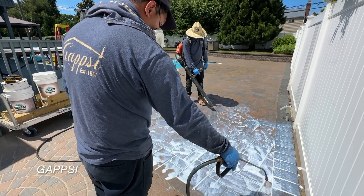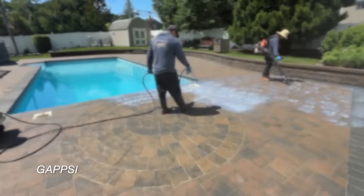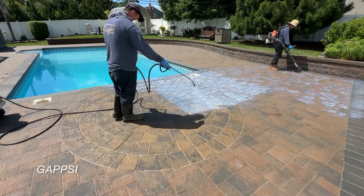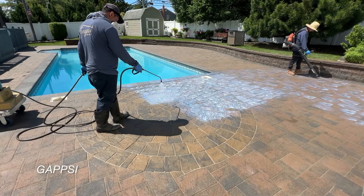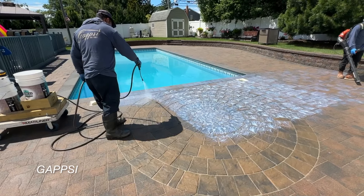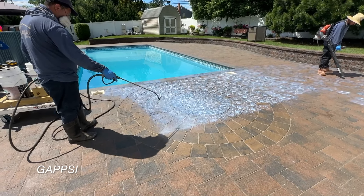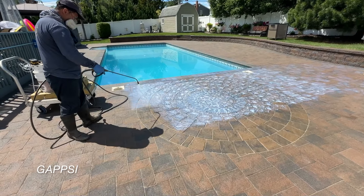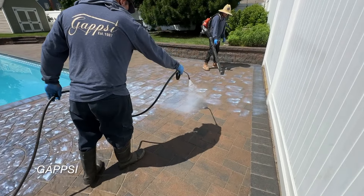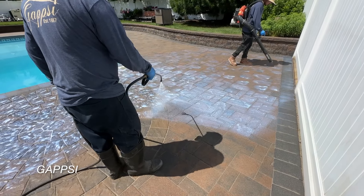We will go one more time, put the final coat, and create a complete uniform coat of sealer on top of the stones. We are applying the second and last coat — this will further seal the surface of the stones and also the sand, making it more uniformly finished. Some stones absorb differently than others, and the first coat seals the stones, but the second coat fills up any voids left on some of the surface. This is a lighter coat but still very heavy and uniform.